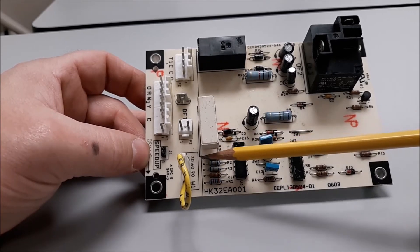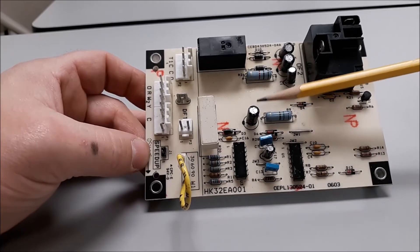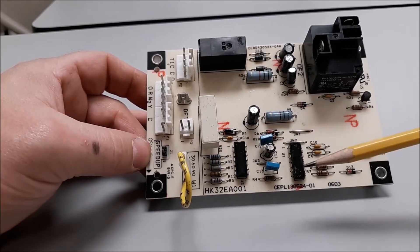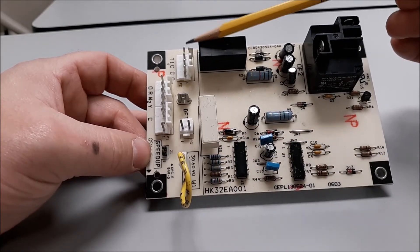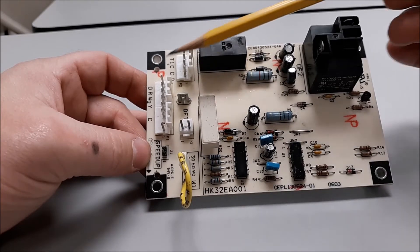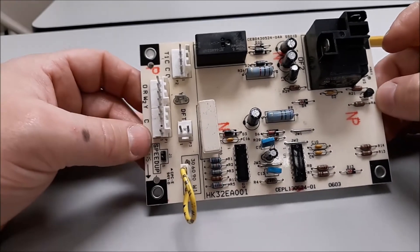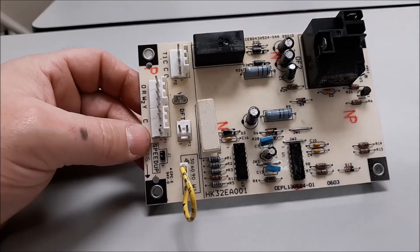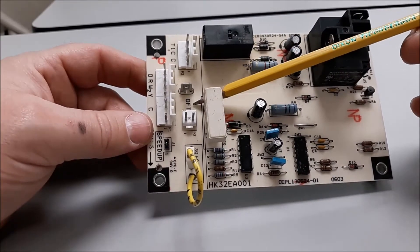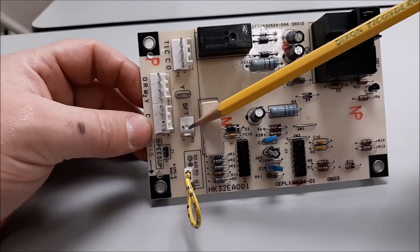Every time you see 30, 60, and 90 minutes, that's a time temperature board. What time puts us into defrost? It's that 30, 60, or 90 minutes of compressor runtime. We verify that signal by checking power on T1 to common — we should get 24 volts. If I get 24 volts on T1 to common, then the logic in here is going to be able to register that. How does it know to start tracking that time? In this board, the temperature comes first.